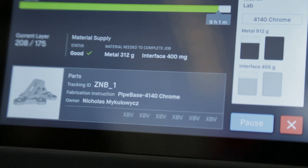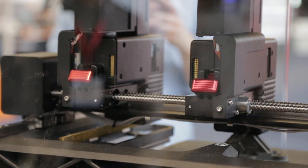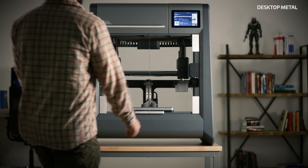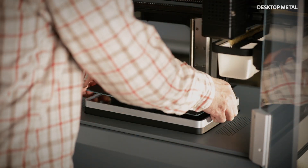We've designed the software from the ground up. We started with the slicer and the technique used to print the part, to support the part layer by layer — telling the operator the best way to build that part. That is then transferred through the cloud to the furnace. The furnace knows exactly what has been printed and therefore knows the profile at which it needs to sinter the object. That creates a solid part. Once you take it out of the furnace, the part can lift right off of its support.